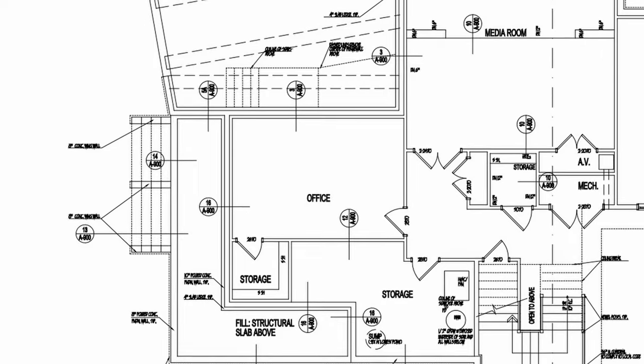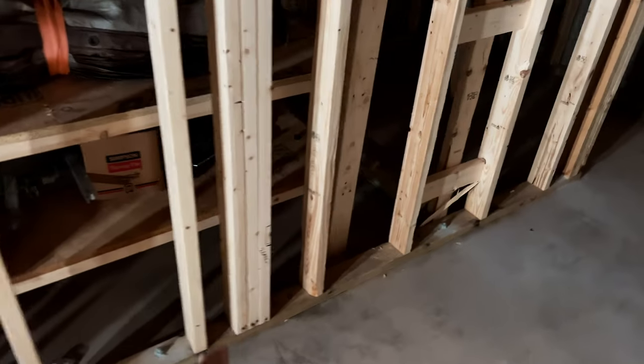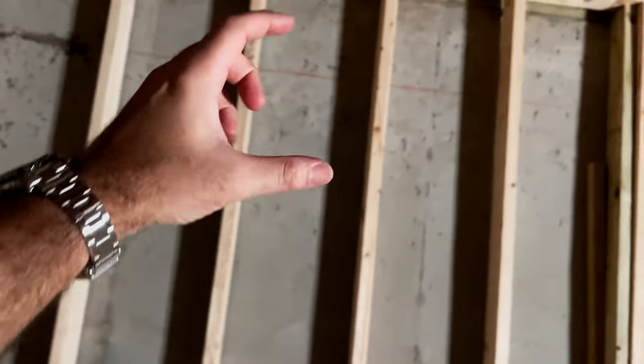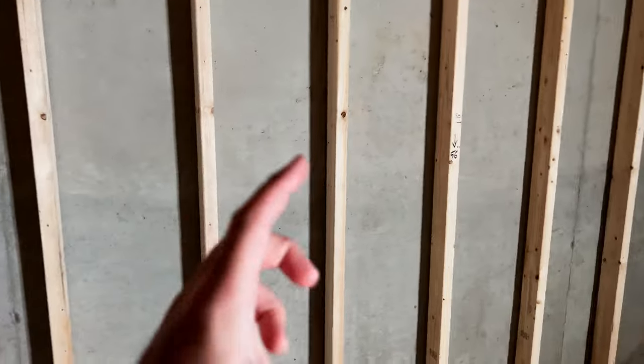This is my office. I'm going to use a bunch of little Definitive Technology satellite speakers that I'm going to reuse. We mapped out a TV hookup on the wall with speaker connections and power connections. The surrounds are going to be at 56 inches — the same height as in the theater room — with back surrounds as well. In this room I'm actually going to do front heights and rear heights using satellite speakers mounted on the back wall and the front wall. This is going to be a fully satellite build, just to show you don't need massive speakers to have an awesome home theater experience.